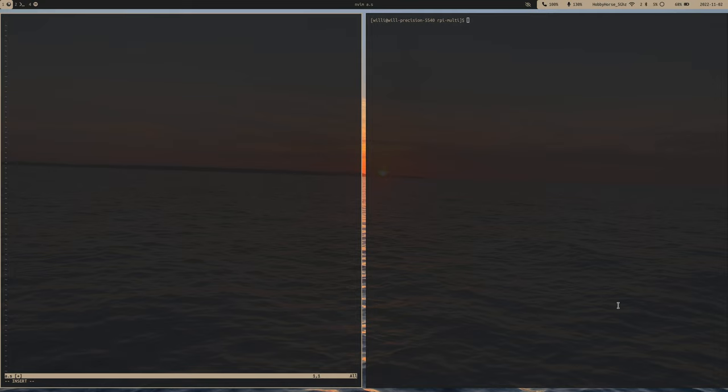How we do this is actually pretty easy, especially compared to the RP2040 with that weird 6-stage chain process. So each core has a mailbox, and this is just an address that we can write to. It's expecting us to write an entry point to that address. So when your Pi first boots up and your main core starts executing your kernel image, the three other cores are kind of in the sleep state, and they're just checking this mailbox.